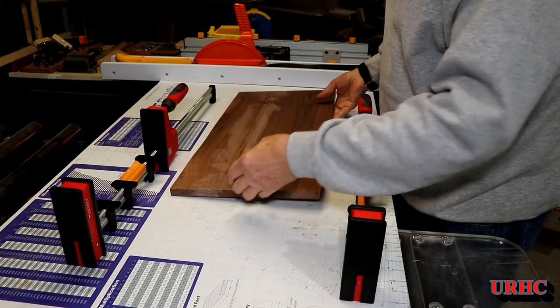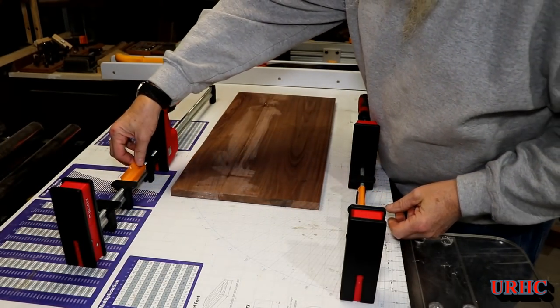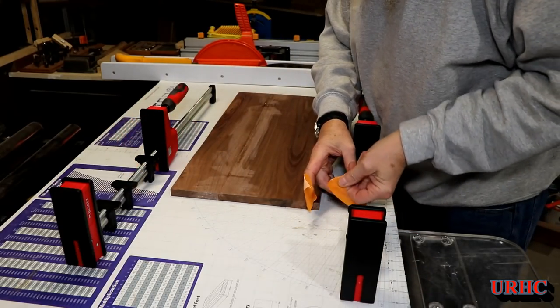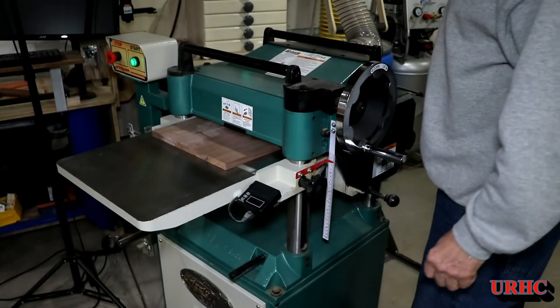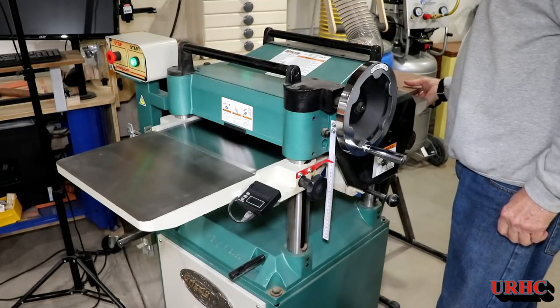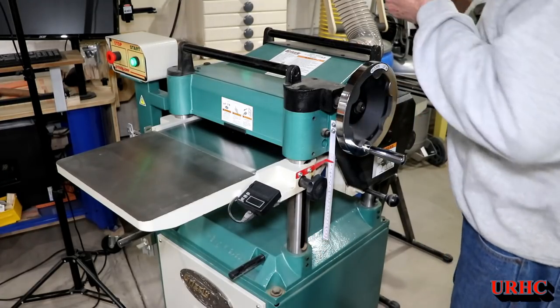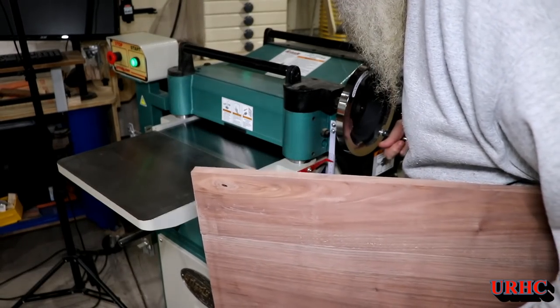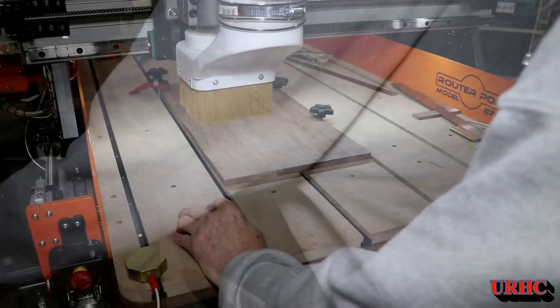This is still a little bit oversized, but you can see where the glue dripped — just pull that tape off, throw it in the garbage, and there's no mess. The clamps stay like new. I'm going to take a couple passes on the planer to get it down to final thickness. I have people ask me about that Wixey planer gauge all the time, and yes it still works great, I really love it.